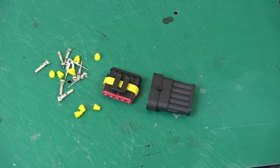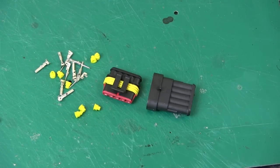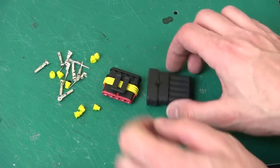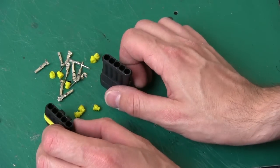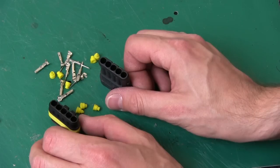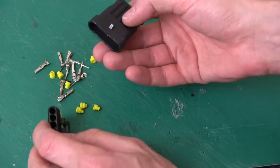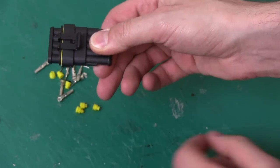I've got some connectors to put all of the wires together with — five pairs of these which I got from eBay — and that means I can attach the head and each arm and each leg to the body where the batteries will be contained. These are quite good connectors: they're five poles each, which means I can take power, I2C, and also the NeoPixel wire to run all the lights. So I can basically take a network all around the suit if I want to in the future. They snap together and they've got a little latch that locks in.